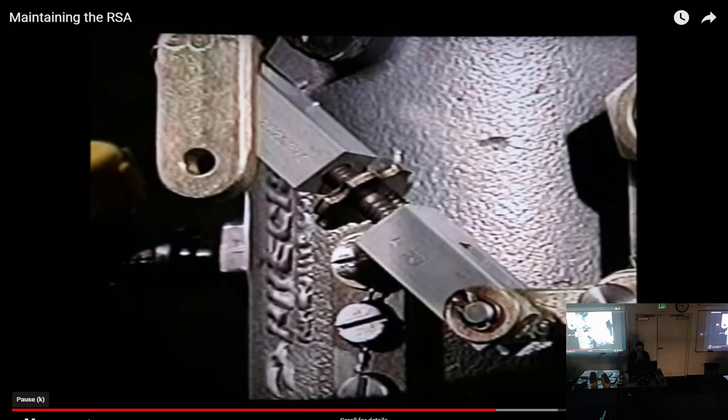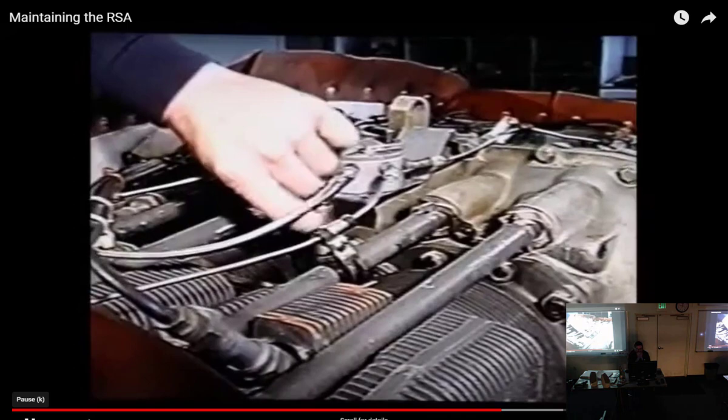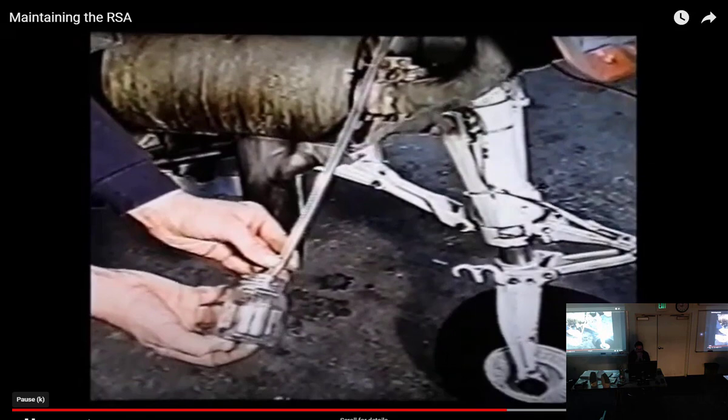If your engine has the tendency to run on with the mixture in idle cutoff, better check the integrity of the servo unit. First, disconnect the fuel outlet lines from the servo. A flexible hose or clear tube can be attached to direct fuel from an end nozzle into a separate container. A baby bottle is perfect because it's calibrated in cc's. Whatever the container, the measurement process is critical.